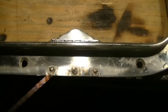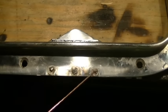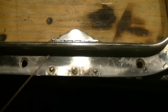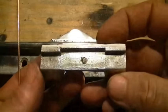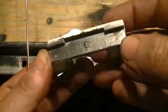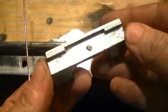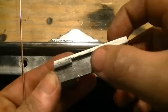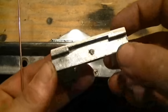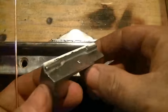Here's a close-up view of the three holes that were drilled and plug welds going through each. I find it interesting that there are actually three individual plug welds because if you look on the hinge itself, you can only see one weld mark. Which means whoever welded this was either inexperienced or hadn't worked on this process in a while. It stuck in the center, but nothing on the ends — it was inevitable that this hinge was going to break off.